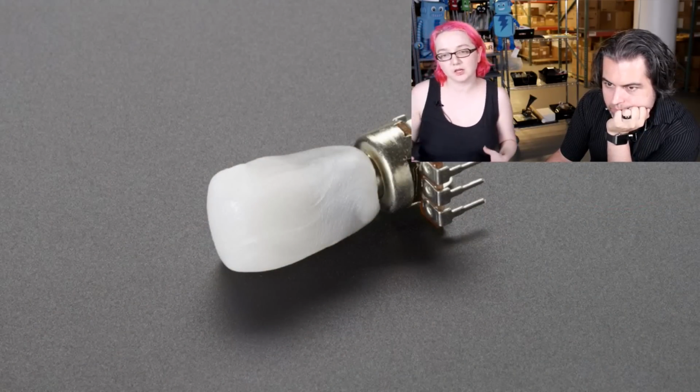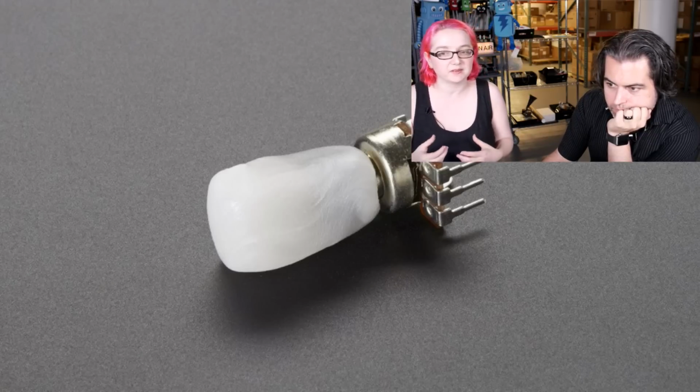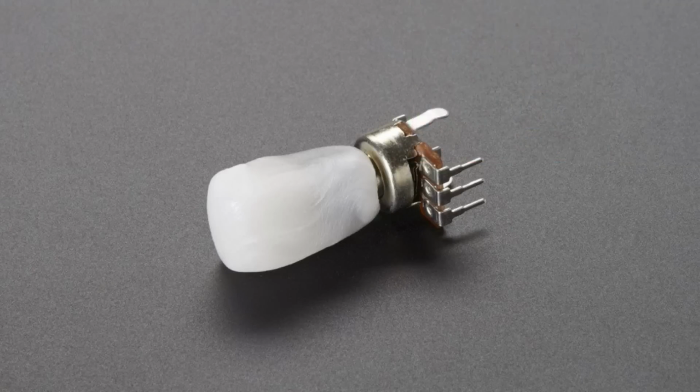It turns into this white color, and it's firm. It feels like the same plastic that milk jugs are made out of, a stiff, a little bit pliable but not flexible plastic. And you can mess around with this for quite a few minutes as long as it stays above that temperature. It's like 60 degrees C or something. It's pliable, and then later on it hardens. But then you can always melt it again.